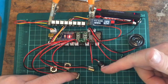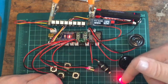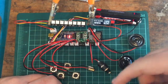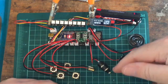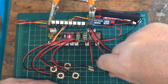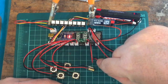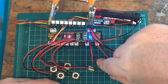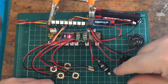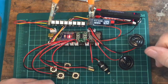The LED red dot laser sight — I mount these inside the scope. Laser sight is activated and deactivated with its button. For magazine detection: I use a lever switch or reed switch, but for this demo I've got a latching switch. If I take the magazine out and break the connection, you get a warning weapon error and it displays on the screen that you need to insert your clip. Insert the clip and you get a sound to confirm it's inserted.